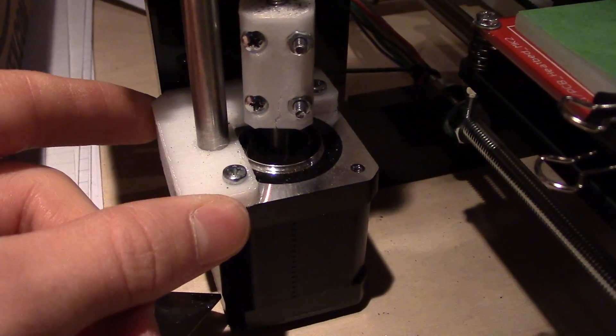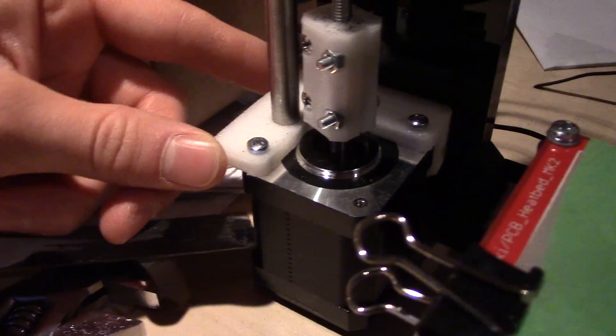There's also another motor mount for one of the Z motors — not the couplers, I already printed the couplers, but the motor mount itself. The holes for the screws didn't print properly. When printing the screw holes, it prints a circle around it on every layer, which is understandable — print a circle so you can insert the screw. But the problem is that circle doesn't properly adhere to the rest of the model, so on my Z motor mount those circles are very loosely connected, and when I tighten it down onto the frame those little supports just break off. It's a weak connection between the motor mount and the frame, so that piece I'll also have to print. But let's start with the Y motor mount because it's smaller, flatter, and simpler geometry.